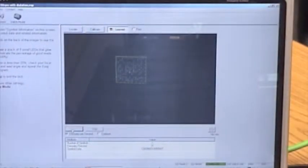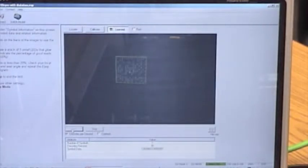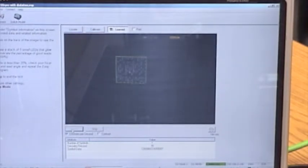Overall, with the read counts we're seeing, this is a very, very good result for a marginal barcode. Let's zoom in and take a look at the exact details. Here in the Microscan ESP software we can see the 2D barcode. It's got a green box around it because it is being read. Looking closely, I can see that the cells are spaced out more than the spaces in between — the underprint is visible — and there is some skew as well, though it's hard to see with the green box around it.